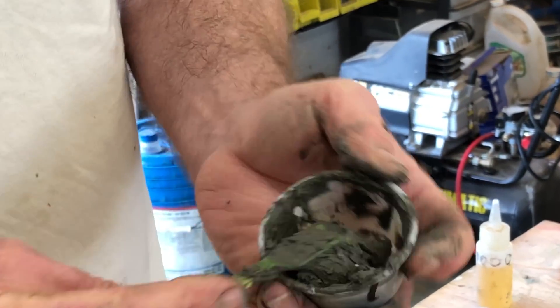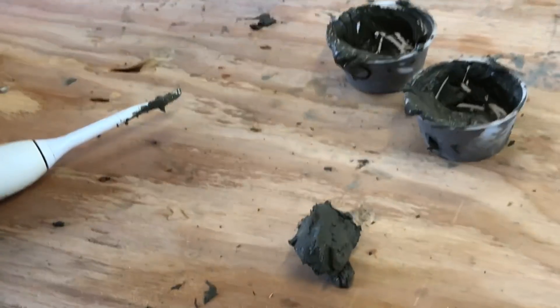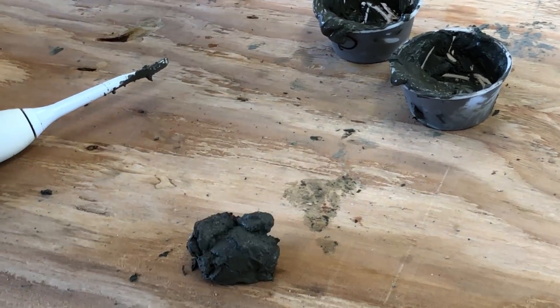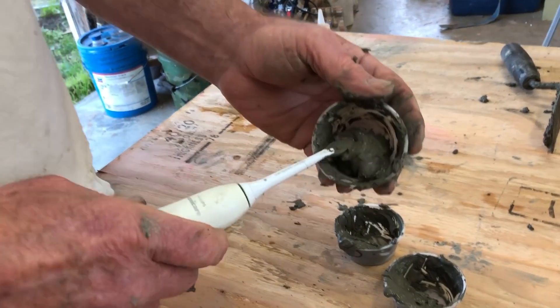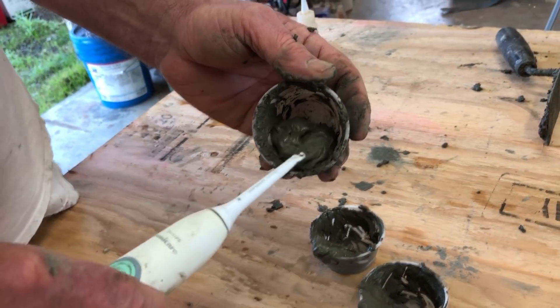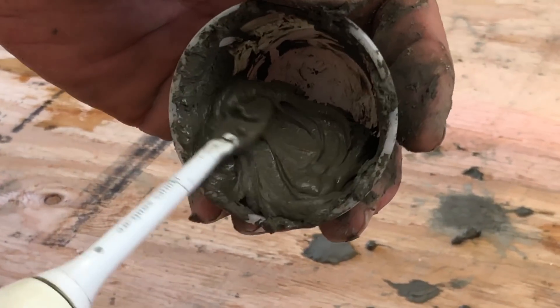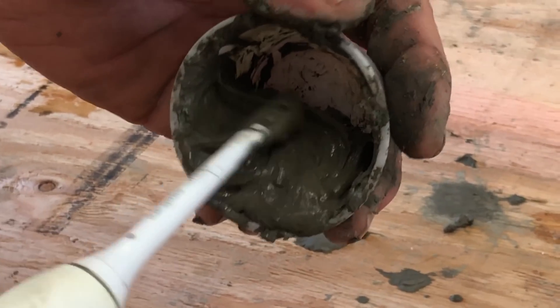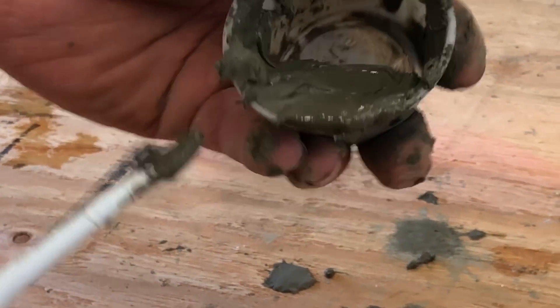We have this one that's like — let's see if it bounces off the table just about. You can hear that thing thud. But you can get it to come back to a liquid with the vibrator. Not as much because there's less water in it, and it will always be a little bit stickier. But you can get an extremely strong concrete with a very low water-cement ratio this way.